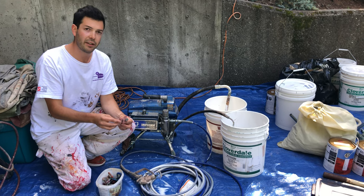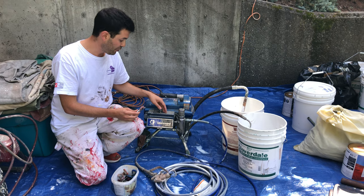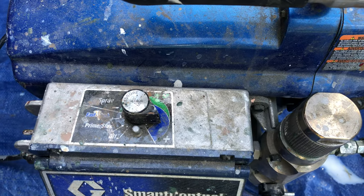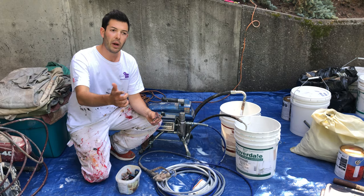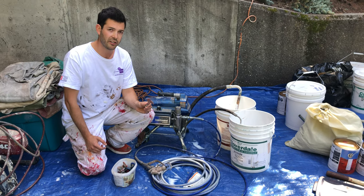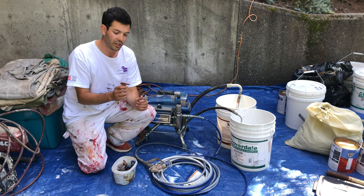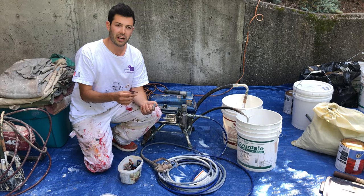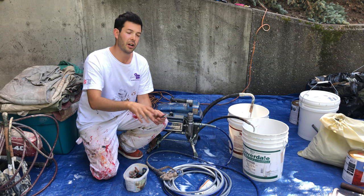When you're painting, if you're finding issues, note that these machines are supposed to be run at practically full or almost full pressure. So if I adjust the nozzle, I go to full and then might turn it back just a bit. A lot of people think you have to run it at half or even less, but that's not the truth — you really want to be doing it at full pressure. What's going to limit how much product goes on and how much it drips is the tip size. It's really important to understand you can't use one generic tip for everything. Tips do wear out — get new ones every 100 to 150 gallons, because instead of a thin line you can control, it'll become more of a circle, and you'll be wasting product with a lot more overspray.